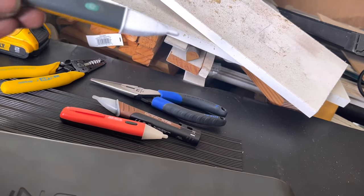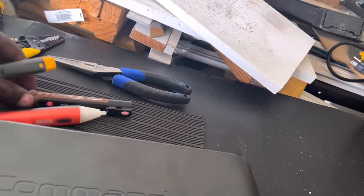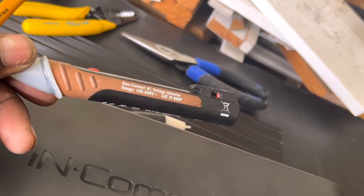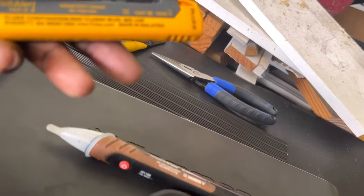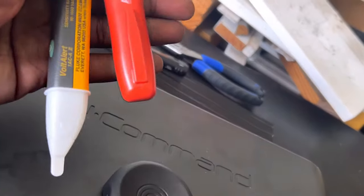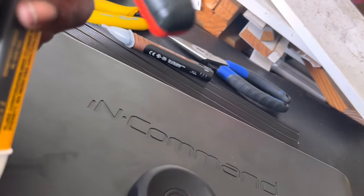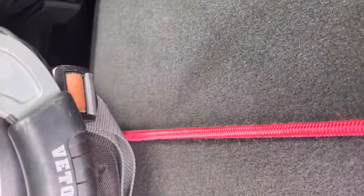Now I have adjustable sensitivity, a very low-range one, and a higher one closer to the 100-volt AC range in here, plus my Fluke. The Fluke is on the higher end, so I'll take that one out. The Southwire — I got hit a couple times, but it might have been because of low voltage since it's on the higher range. This one's rated at 90 and this one's at 100, so I wouldn't need both — I'd pair the Fluke with the Harbor Freight one since that's rated at 50 volts on the lower range.